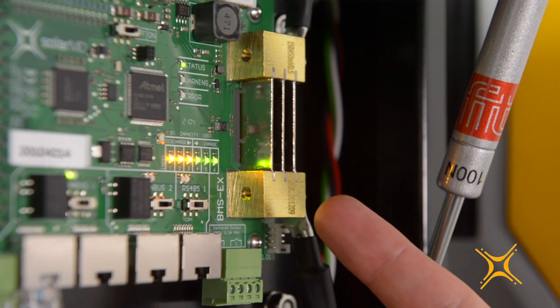This sensor will automatically and periodically sense if there is a voltage on the load side of the protection relay. If the voltage is higher than the battery pack voltage, the relay will close to allow the battery to start charging from the connected source. BMS EX is fitted with a 150 amp calibrated shunt. The shunt offers very accurate current measuring with a resolution of 10 milliamps, measuring every 143 milliseconds. The measurements are tracked over time by the BMS to accurately determine the battery state of charge.